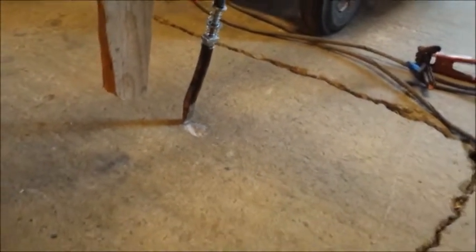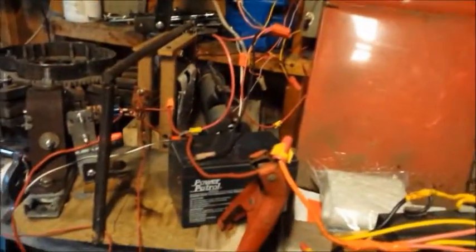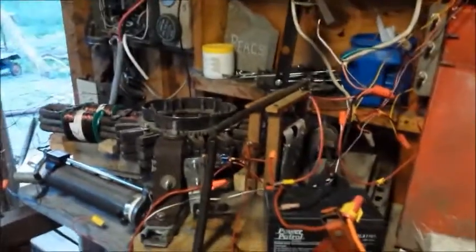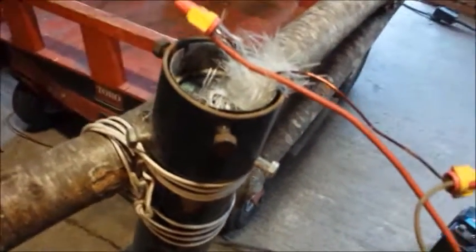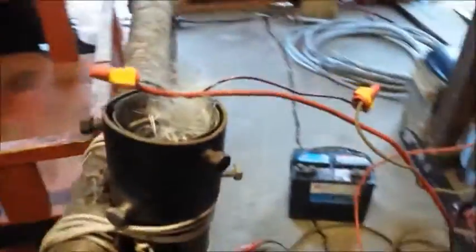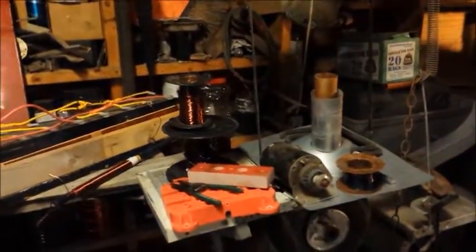So, that was a fresh cement floor a few minutes ago, and this is concrete, and that chisel is soft, and that wheel is all whacked out, as you can tell, but it's starting to chip. I've got some winding issues, as you can see. I'm still using the recycled wire that came from an old battery charger, so I need to wind some sweet 16, that kind of wire, good magnet wire. And see, this is aluminum wire, and I pulled it off, so who knows if there are shorts.